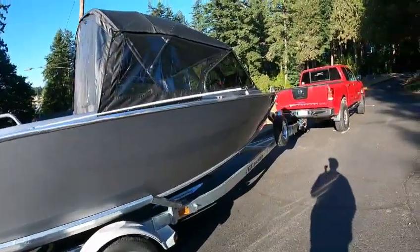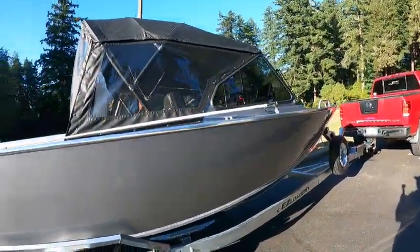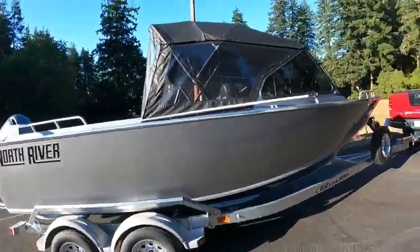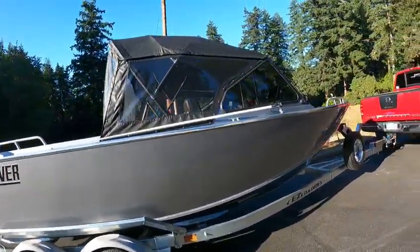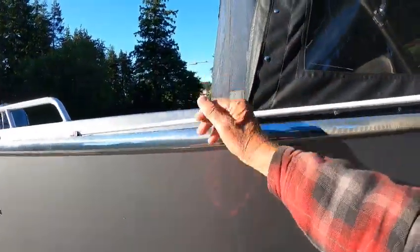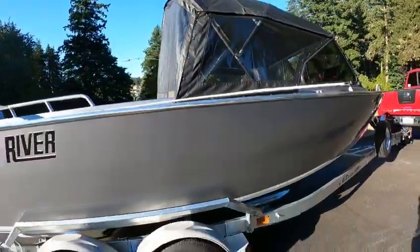Beautiful boat. It's got a good antenna — it's all about the antenna, not the VHF, remember that. That's a thick chrome base, it probably reads the whole eight feet. If you get a cheaper antenna, they're a little skinnier with plastic ends and they only read the top third. That's why sometimes you can hear them but they can't hear you.